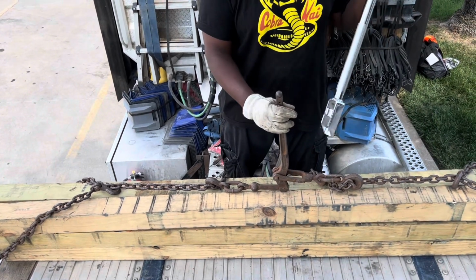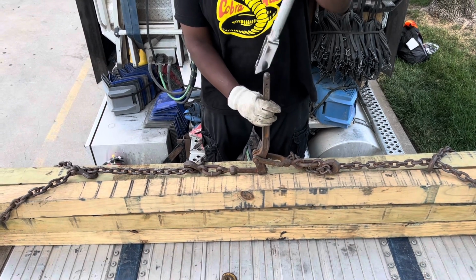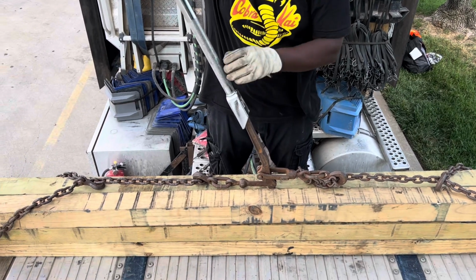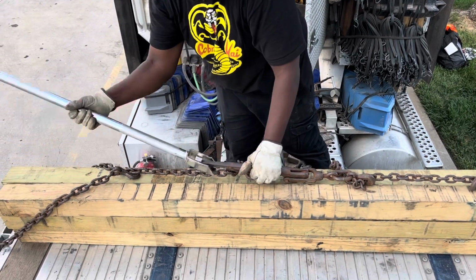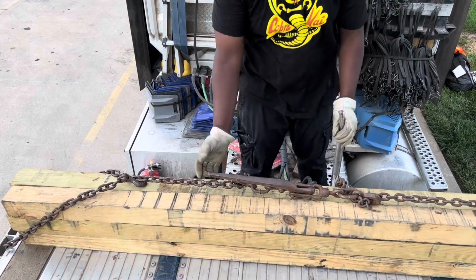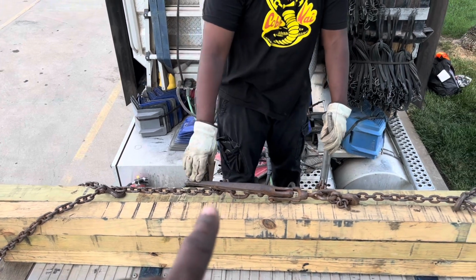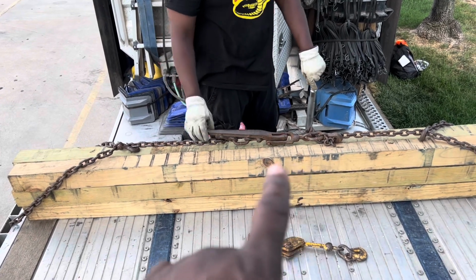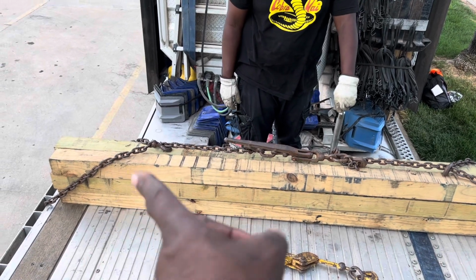Now, we're gonna pay attention to how this binder is gonna snap. Okay, and I want you to pay particular attention to that leverage right there. When it comes over, it's gonna break it, and then it's just gonna snap hard. Bam, right there at the end, okay? Now, Chris, just try to lift up to release a little bit. And you see it, hold on right there. You see how that thing doesn't allow any movement. Try it again, Chris, just a little bit. You see how the whole thing is locked down? That's 100%. It has fell over and then snapped and locked 100%.